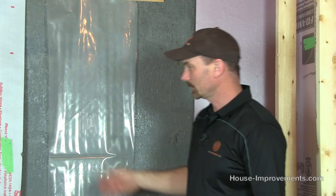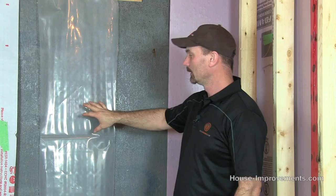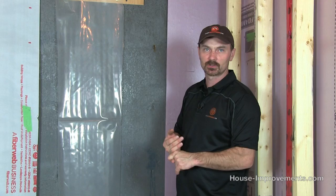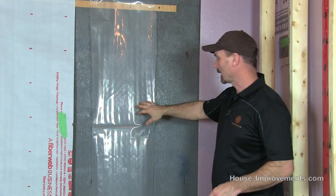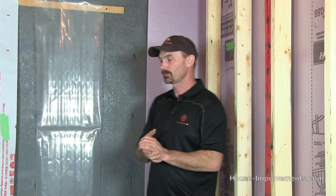That's pretty much all you really need to know. We do have a video showing how to install the rigid foam, and another video dealing with the moisture barrier where we did the poly one in a bi-level. In order of preference: spray foam would be my first choice, but obviously cost is usually the determining factor. Number 2 would be the 1-inch foam on the wall. Number 3 would be the house wrap. And my last choice would be the poly. The reason is that house wrap breathes a little bit better yet still sheds water, where poly sheds water but doesn't breathe as well. Hopefully that cleared up some of the misrepresentation of what a moisture barrier is.